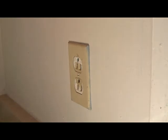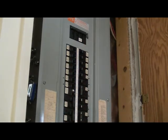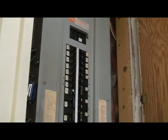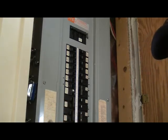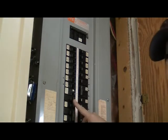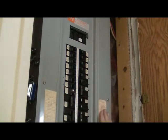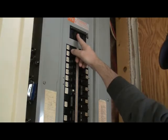Here we are at the breaker panel. All these breakers cover all the branch circuits throughout your house. You have your main breaker and then your listings showing what each breaker stands for. Because that receptacle is two circuits, it's going to be on a two-pole or double breaker. It says countertop plug — it's breaker 17/19 — turn that off. If your labels are gone, turn them all off, or better yet, turn off your main breaker. Better to be safe than sorry.